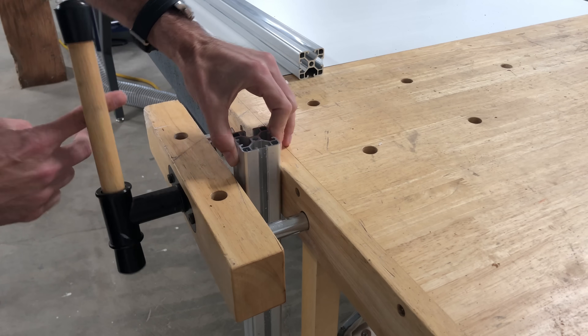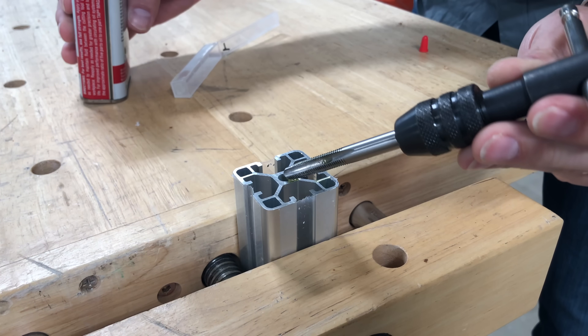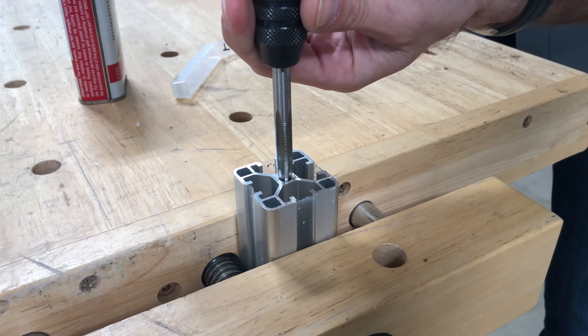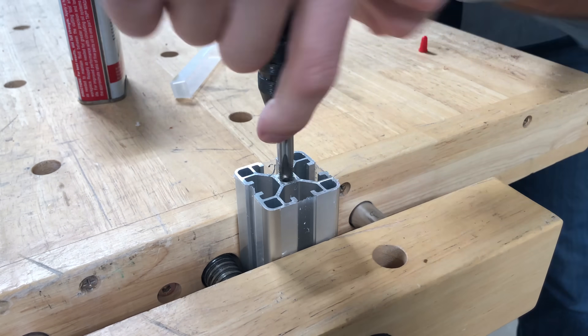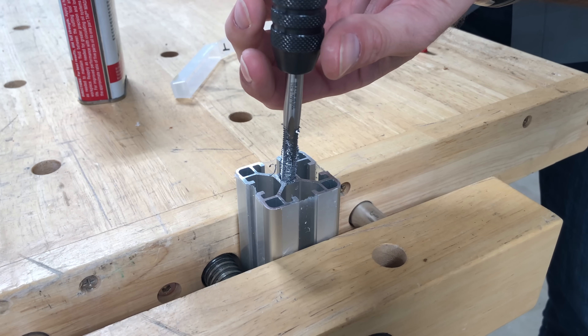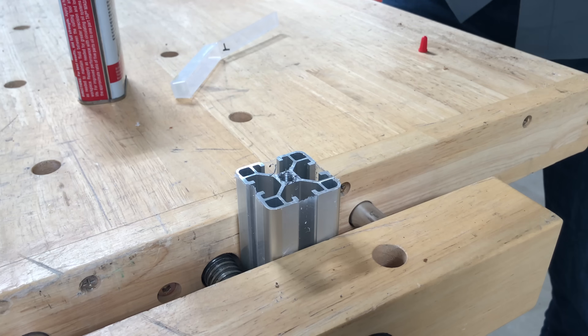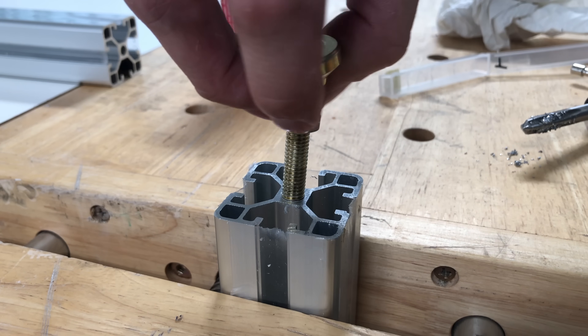The results are less perfect, and everything is much more difficult. So the first step was to build the base. I chose to use extruded aluminum tubing because it's lightweight, super strong, and flexible — you can build just about anything with it. The first step is to tap all of the legs so that they can accept threaded leveling feet.